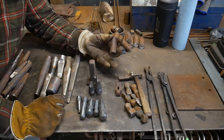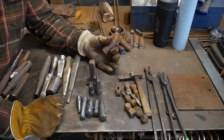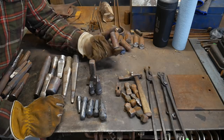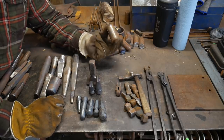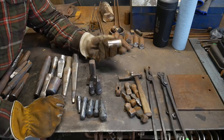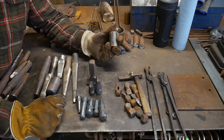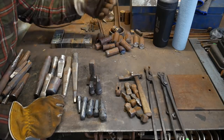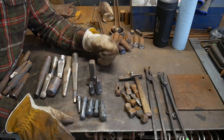Right here I've got some nice 1080 — it's right around a 1080 or 1084 series high carbon steel, just a regular carbon steel, nothing special, no real crazy alloys. And then I've also got stuff that I'm making tooling from that needs to withstand a lot more heat, out of H13. I'm learning about the difficulties of working with H13, and I'm going to experiment with S7, which is more of an impact-resistant steel, whereas H13 is more of a wear-resistant steel — it is harder than all get out.